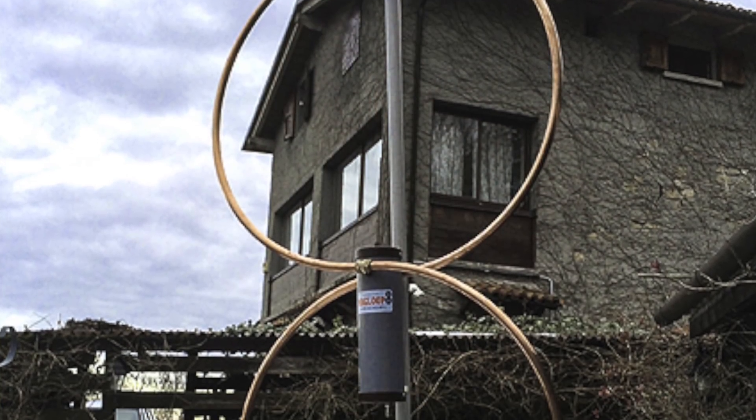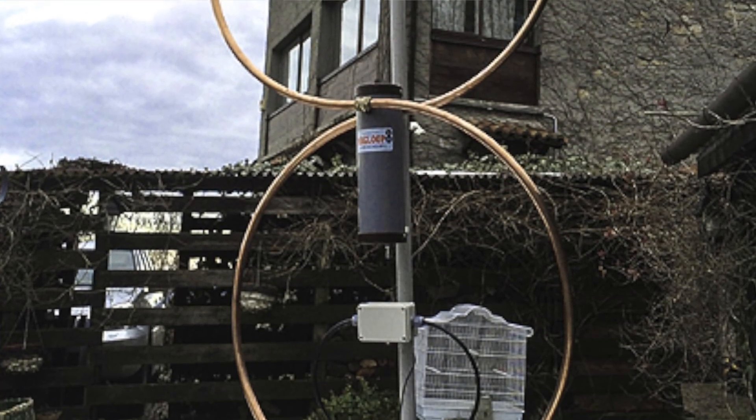We'll turn that into two loops of five-meter circumferences. I don't know what that is in diameter — I'll have to check that and get some maths out in a minute — but I'm roughly going to be 1.2 meters diameter. We're going to make two loops out of that, and then I'll invert one of the loops and solder it to the continuation of the top loop. I'll have one loop above the other, one continuous loop. If you can imagine a big loop and you twist it through 180 degrees, you'll get a figure of eight. That's what I intend to do, and I'll put the capacitor in the middle.